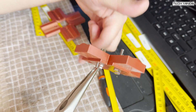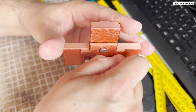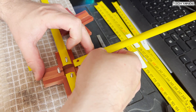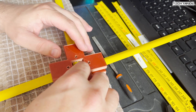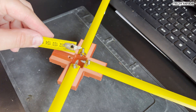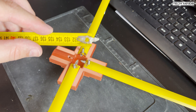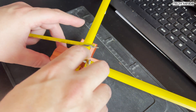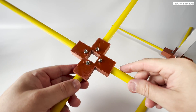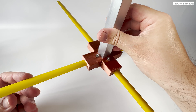The first 3D printed assembly I put together was the top section which holds the director elements in place. I used M4 nuts and bolts, 25 millimetres in length. The elements need a hole drilled in them so the M4 bolt can go through, and then when the two halves of the 3D printed element holder are put together the elements stay in place. Next I soldered some little tags onto the ends of the dipole elements so that we can attach the cable harness later on. You will need to scrape away some of the paint on the tape measure to get to the bare metal. The solder flowed surprisingly well on these elements when attaching the lugs. Unfortunately the lugs were a little bit too wide so the 3D printed parts did not fully close up, but the M4 bolts should hold them in place just enough. I also put together the reflector assembly in exactly the same way as the director assembly.